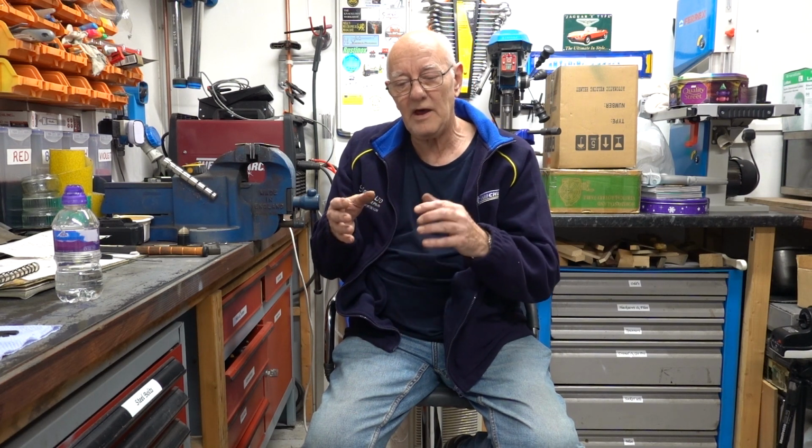So this idea is to try and make something that's compact, where the blade won't be far away from the centre spindle bolt, and also extending the side of it. Had I a bigger piece of steel I would have done it all in one, but I haven't. So it's an extension to pick up one or two of the next T-slots on, so you're not just holding on the back T-slot, you're holding on two T-slots. Again, my logic might be all wrong, but I just thought it might make it a lot more stable.